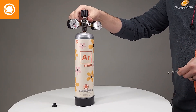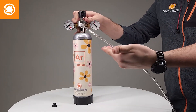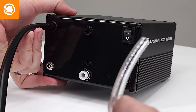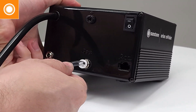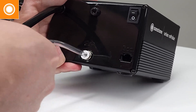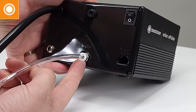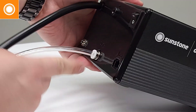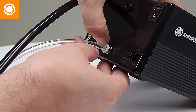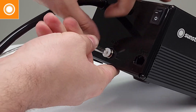Let's put that back in, then go to our welder and plug the opposite end of that clear hose in. Our welder has a similar connection — just push that in and it won't come free. To demonstrate removal, push the white collar towards the body of the machine. I find that pushing top and bottom makes it come off very easily. So let's push that back in and go back to our regulator.